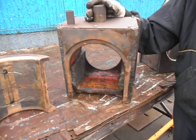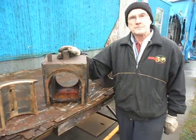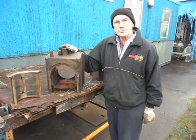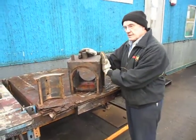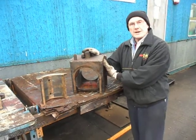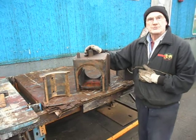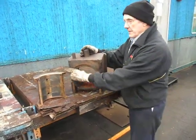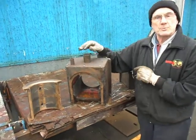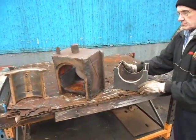So the decision was: A, improve the lubrication system; B, renew the axle box sumps. Unfortunately, with these axle box housings being symmetrical, we could actually turn this round on the installation on the loco, but the bearing would then have to fit the other way around. So I'd like to show you the actual units that we've now made.